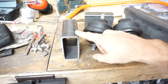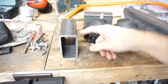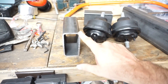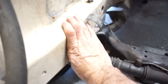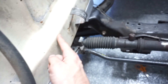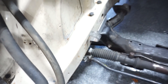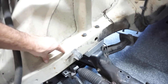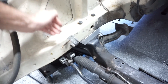The plan is to take this piece and cut it all the way across at this corner, and then cut it all the way across down here, and I'll be left with two angled pieces. Those angled pieces I want to use to hang over the top of this thing right here. I'll have a piece that hangs on the top, the rest hanging down to here, giving me a surface to weld to. That piece will also be welded to the vehicle. The mounting point is actually going to be way forward of the bolt holes, so I'm just going to build a new section.